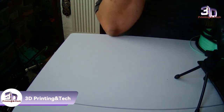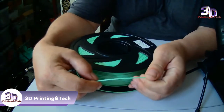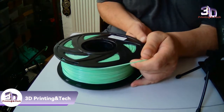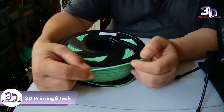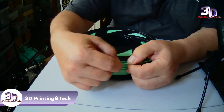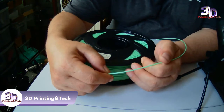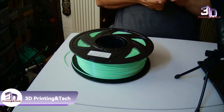The melting point is a bit different. I printed with this filament at 210 for the first layer and then 200 for the rest, so it worked quite low for an all-metal hotend, which really surprised me. I've had a look at the filament and felt it — can't feel any bubbles, no lumps or anything. It is quite smooth, and when you print with it it's quite smooth.